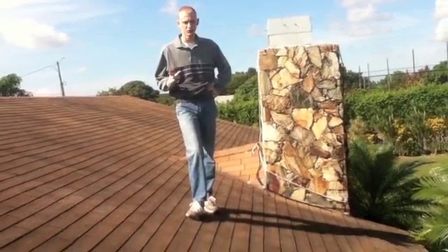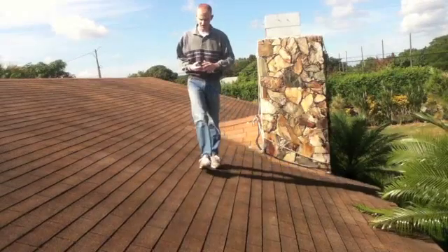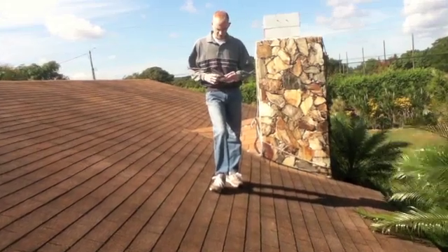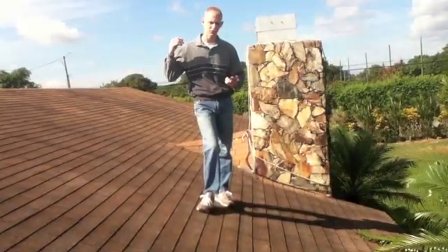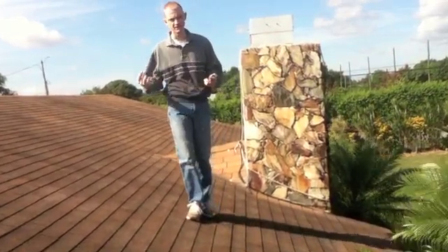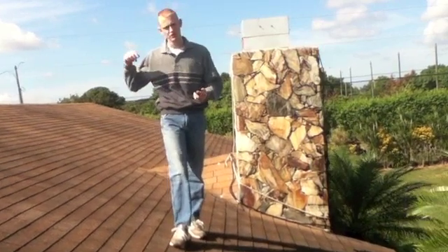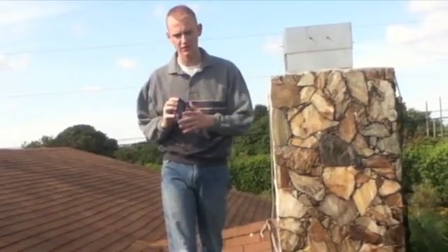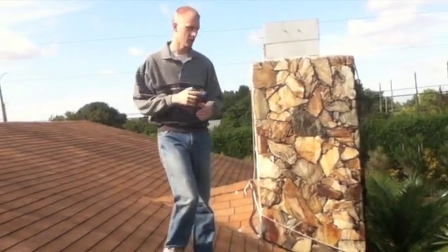I decided to automate my Christmas lights this year to a 30-minute show. This is where the nerdiness comes out. At the heart of this automation is an Arduino. I have it set up with a piece of code that takes USB serial output from this open source program called VIXEN - V-I-X-E-N. I will have a link in the description. Using this program you set up your channels and you automate the lights. The Arduino decodes that information and sends it to your outputs, which will be relay switches.